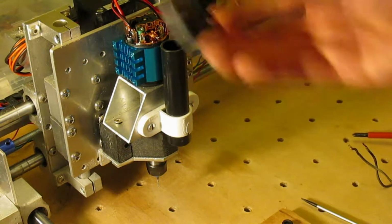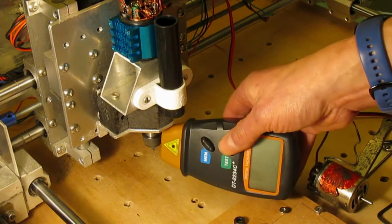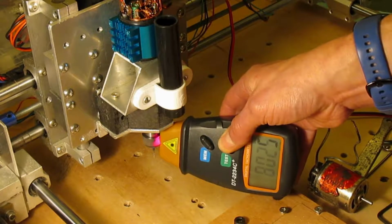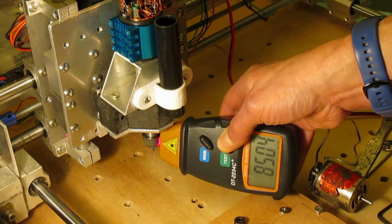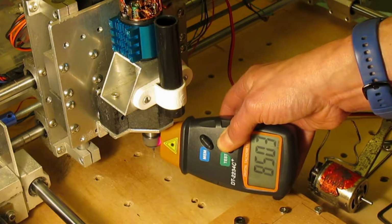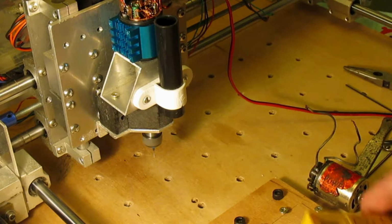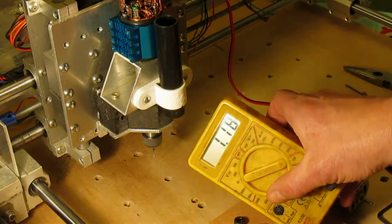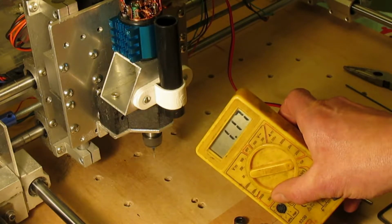But the cheap cooling fan did not work. So, how fast is the new motor? Only 8,500 RPM. That's a little disappointing. It's pulling just over 1.2 amps, so that's only about 8.5 watts, not what I was hoping for.